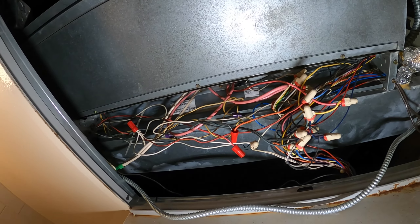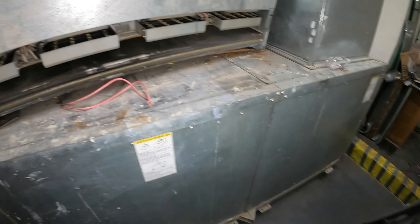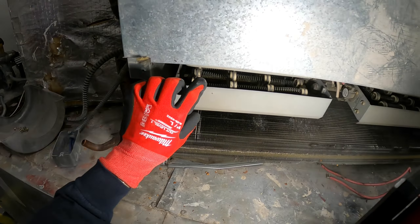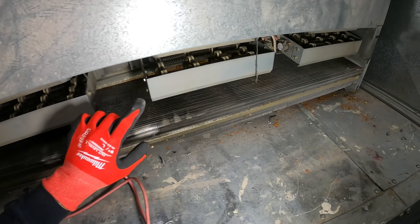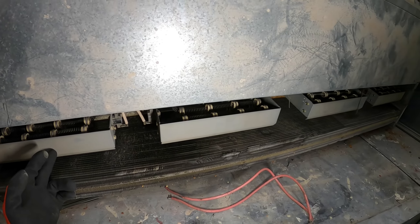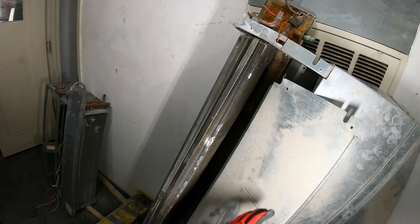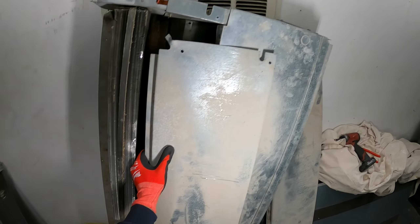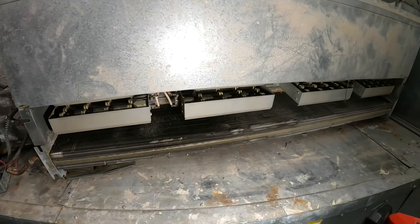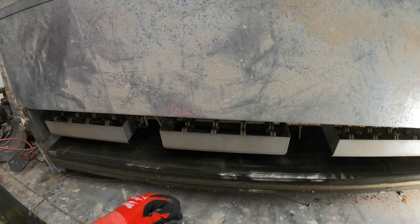For now, let's go downstairs to the mechanical room and pull those old heaters out — we're gonna have to test them. We're in the mechanical room right now. It's a large HVAC unit — a four-pipe fan coil unit that's heating and cooling all year round. We've got a spare unit here that runs off 208 as far as the heaters, and we got four of them — four electric heat strips. I was actually here during the last visit and I pulled out four heaters out of this unit, but nobody knows where they are now. So I've gotta figure out if these heaters are even good and do some testing before I install them.